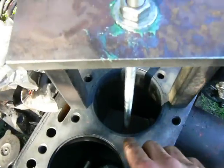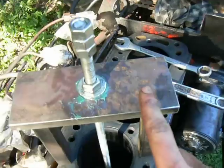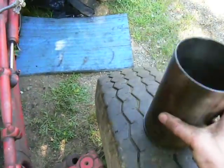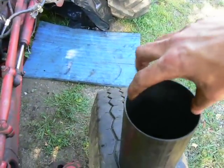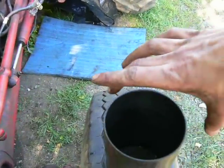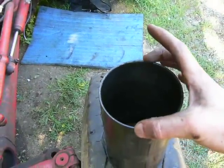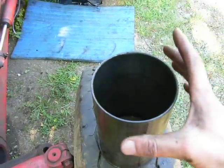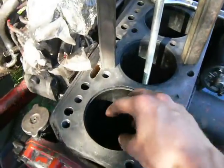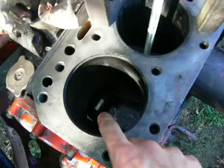for me. Down in there you can sort of see there's a plate that's just about a half-inch plate, sort of this material, with a shoulder in it. So it sits in here, and the shoulder prevents the plate from sliding too far one way or the other. And the OD, or the larger size of the plate, is maybe 20 thousandths smaller than the OD of the sleeve. So as I pull the sleeve up out of the engine, that plate in there doesn't get hung up on the block.